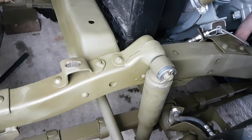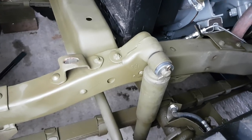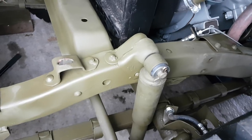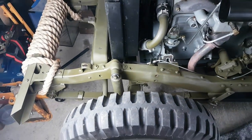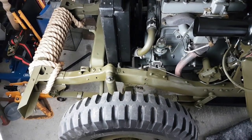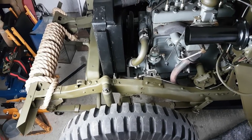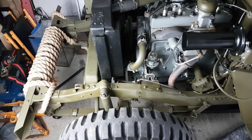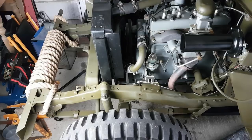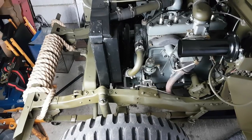You can see how that rivet elongated the hole, so rather than building that up we've put a dab of weld running around the bottom, taking the job that rivet would be doing. It's not very noticeable now it's painted — if you got up close you could see it's been worked on, but further away it looks pretty good. It's a field repair — if you're being unfriendly you'd call it a bubba repair, but I'd like to think it's a little better than that. Out in the field they wouldn't have had a huck rivet machine, so a bit of weld on there — probably messier than that — and your job's good. We'll get everything back on and take her out.